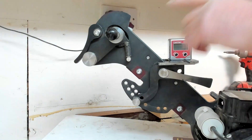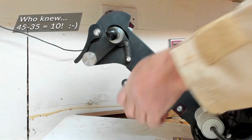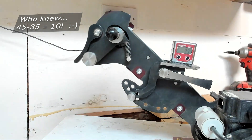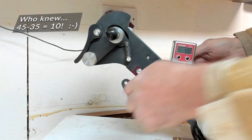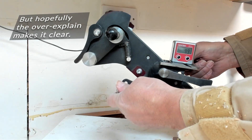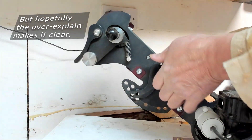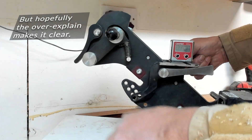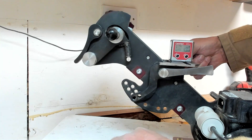I've set it to 45, put my angle finder on there, and set that to zero. Then I've set that to 35, and my angle finder says 9.9 — we'll call that 10. So the difference that I want is 5. I turn the table up until it says 5, grab my pen, and make a mark through the inner hole, because I want it on the inner circle.